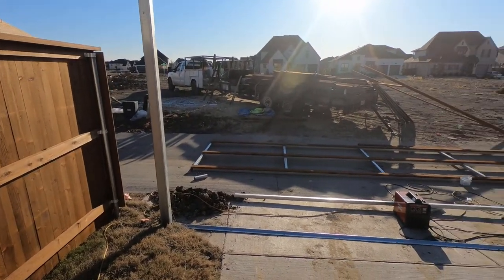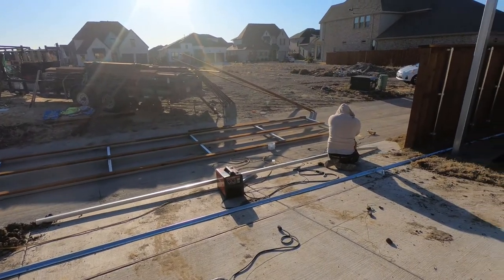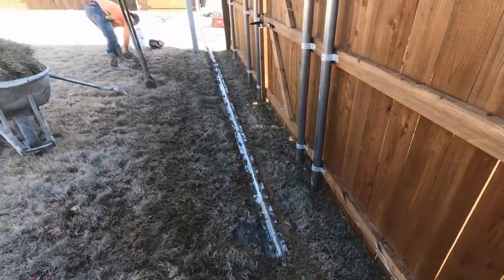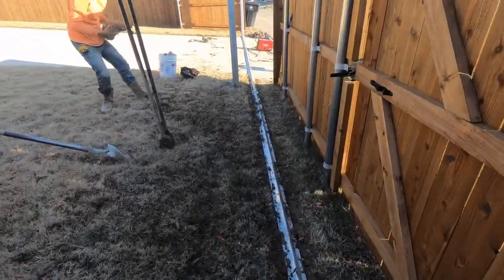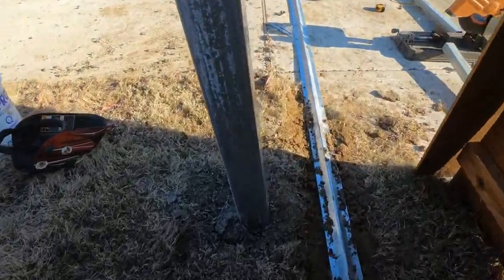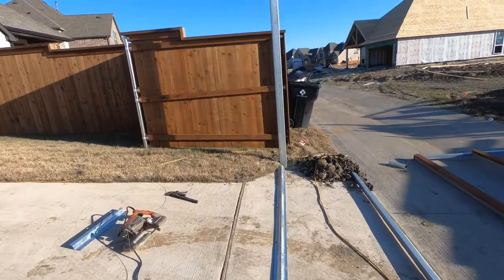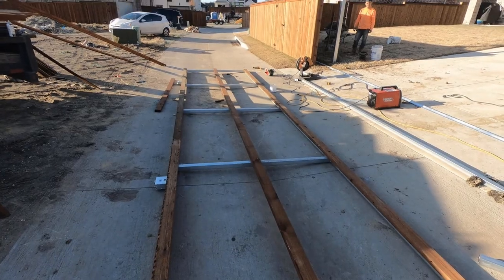A big beautiful roller gate like this one really has four components. It's got big four by four inch posts sunk 42 to 46 inches deep in the ground with concrete. It's got that v-track on the ground that it actually rolls on, so that v-track is in the ground and it's bolted to the driveway too. Here you can see it's in front of the fence where there's room for it to slide back and forth. There's a picture of that post deep in the ground with the concrete and that track as it is bolted to the concrete. You can see the gate being built out there in the driveway. The gate frame is 2x2 galvanized welded steel.